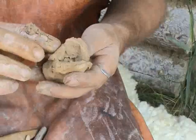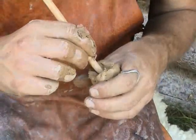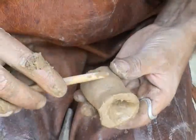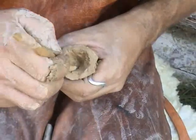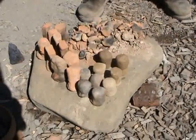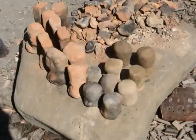The ingate or casting funnel is attached. This way the wax can leave the mold and the liquid metal can be poured into it. The mold is now dressed on the outside, as cracks often start from irregular surfaces. At this stage we call the mold a green mold as it is still damp. Into these green loam molds, metal cannot be poured. The molds require firing first.